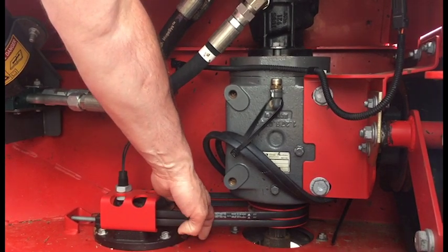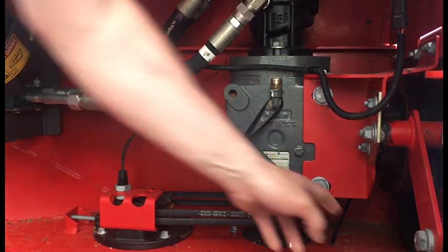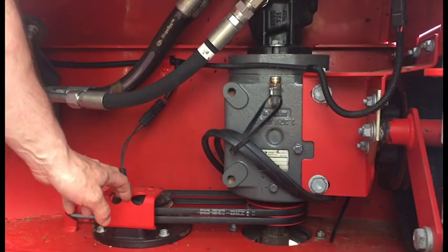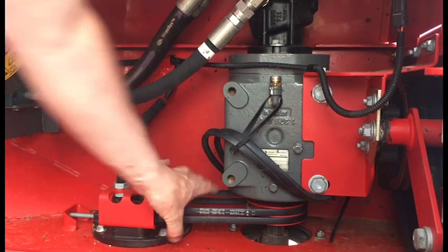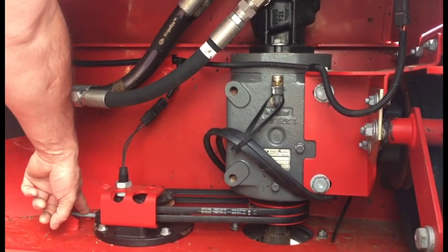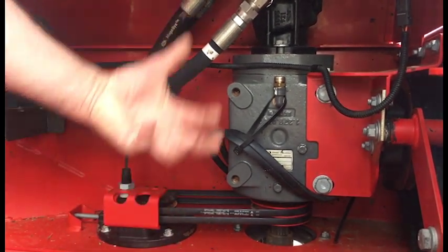So if you do burn a set of belts, you can come with a side cutter or knife, cut those two zip ties, loosen off the four bolts that hold the cage tightener, and loosen the adjustment bolt, drop the belts into place, tighten it up, and away you go. Putting that extra set of belts in there will save you piles and piles of time when you're cutting hay. It's just a simple and easy thing to do while you have everything apart already.